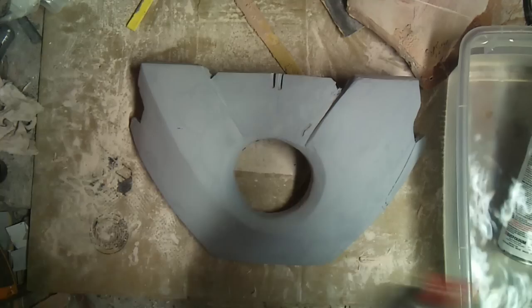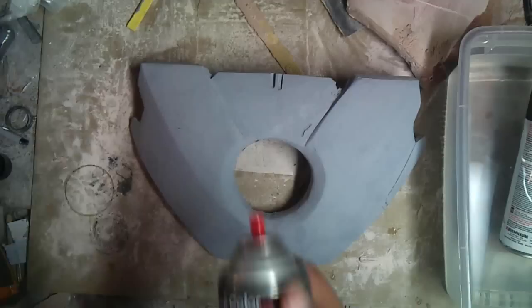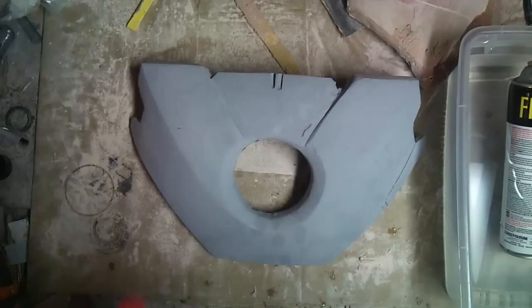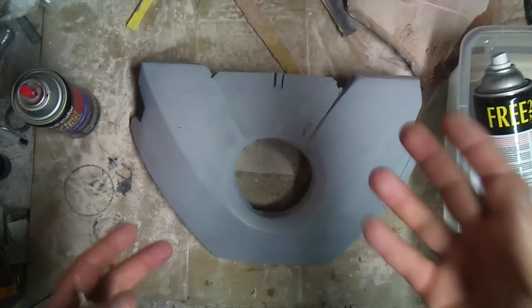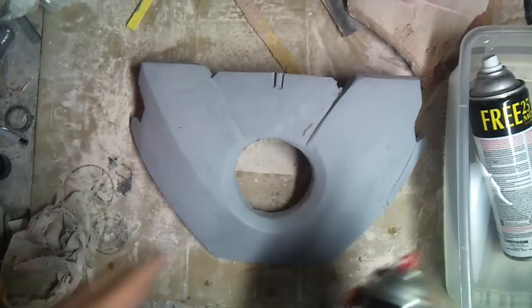When you're dealing with paints, the two main parts are the pigment and the solvent, which helps make the paint spread out more easily. The paint is about as warm as my hand right now. The warmer the paint is, the more it will dry as it's shooting through the air. Basically we're trying to make the solvent evaporate before it hits the painted piece.